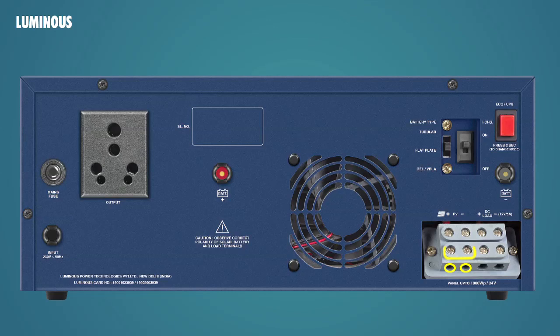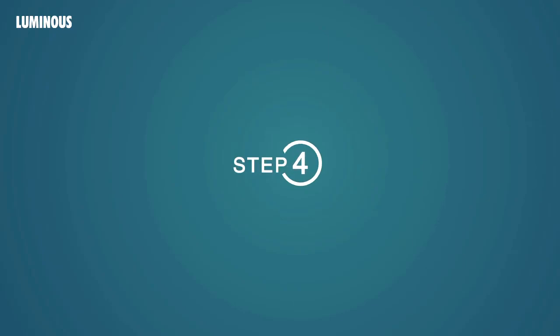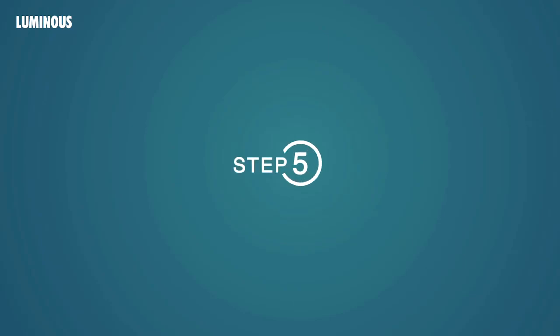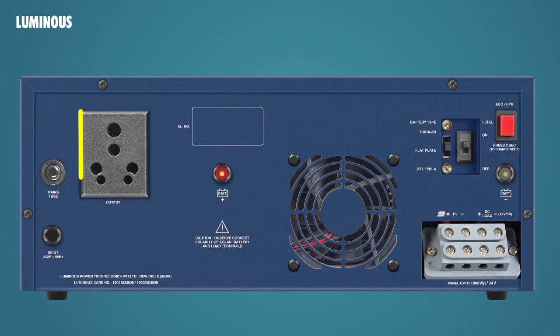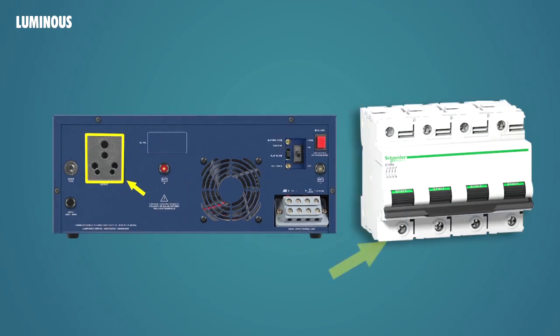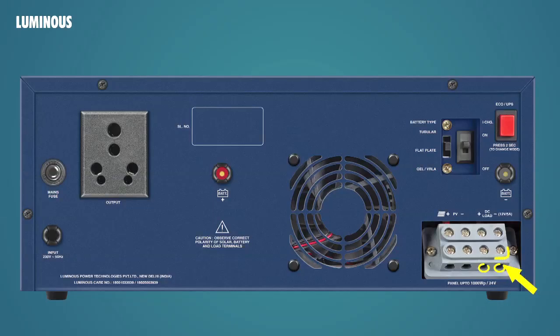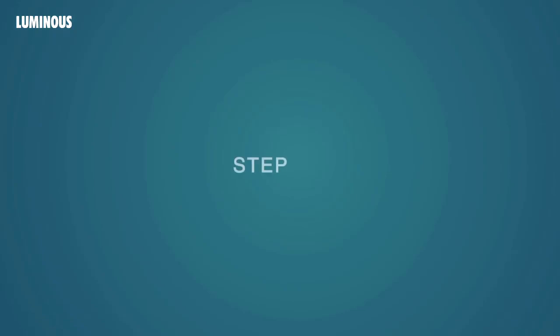Before connection, check that voltage is lower than 21 volts. Step 4: connect this wire to the AC mains input. Step 5: connect this AC output socket to the MCB box — ensure that the MCB is off in this step. Step 6: DC load up to 12 volts can be connected to the two right terminals in the terminal block. Ensure proper polarity in connections.